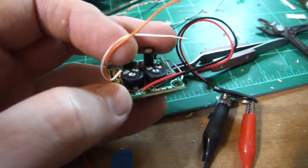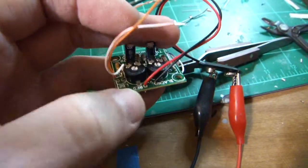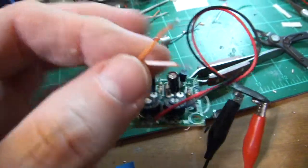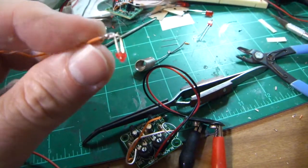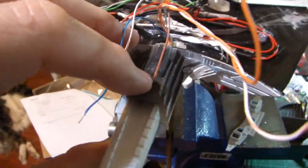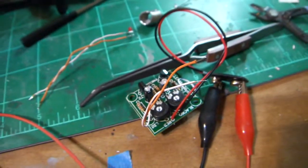So what I've done is I'm going to wire up off of this one. I have jumpered the connection for the other side, so this side will work, and instead of being on solid, so there's no LED there. And I have wired this up, so I'm going to take this lead right here and wire it up to this little 1.8 millimeter LED. If I can get it to focus. There we go. The one I showed earlier in the picture. And it will also fire off the LED that I have right here, that earlier in my build I had sculpted to fit in this triangular pyramid shaped piece right in here. And it is sculpted so that it's angular on both sides. So next thing to do is wire this up and get it working.